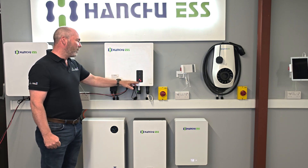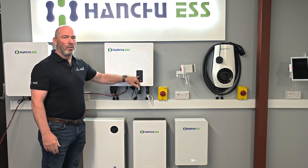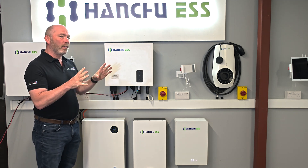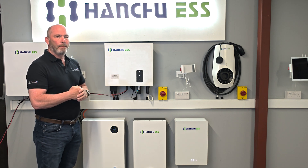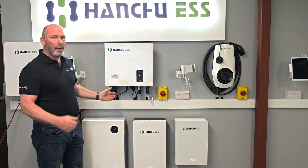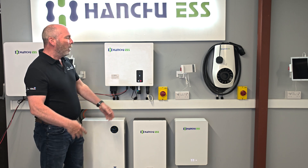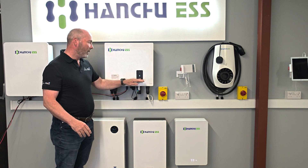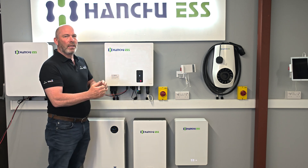That's absolutely normal. The battery light is going to suddenly come on and be solid white — that's what we're looking for. About 45 seconds in, the unit is doing self-checking: we've got two white lights — the solar light and the battery — both flashing. Once it's gone through the full self-checking process you're going to see a solid battery light. That took about another 30 seconds. We now have a solid battery light, so we know the power is connected correctly and the communication is correct from the battery. We've got red on the AC side because we haven't turned the AC on yet, and a flashing EPS because there's nothing coming out of EPS. The first check is just a solid battery light.